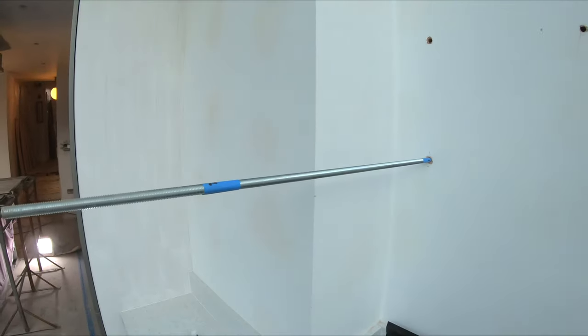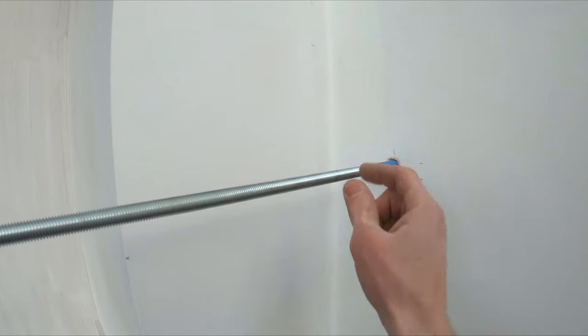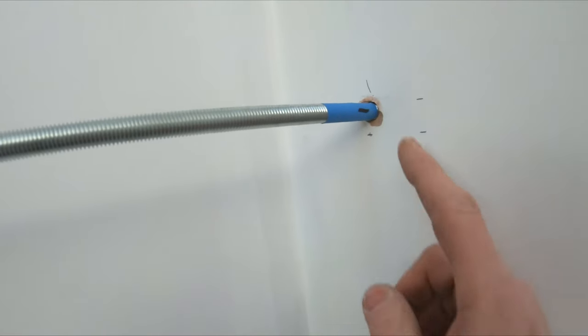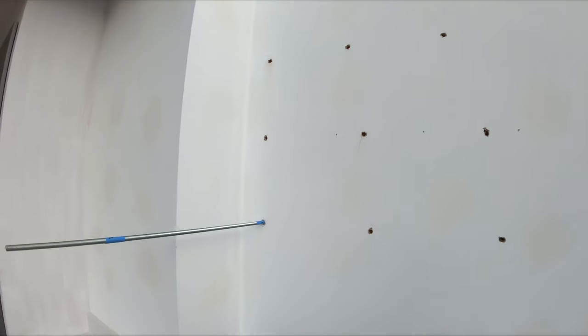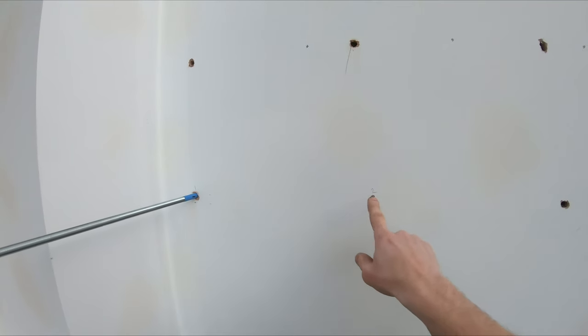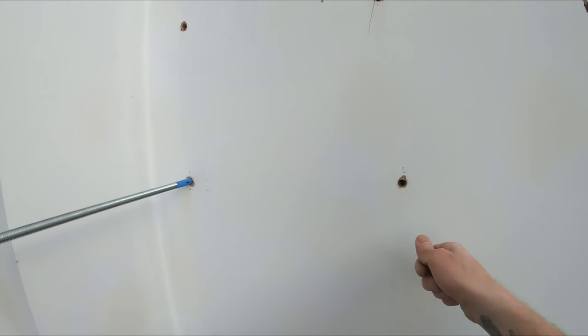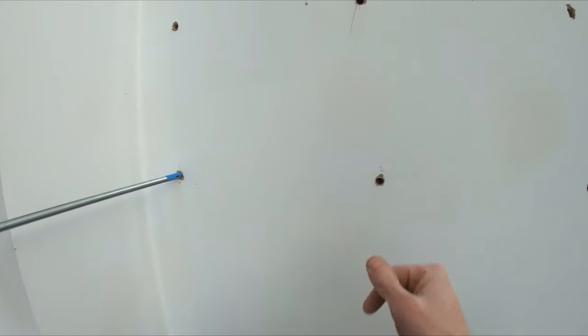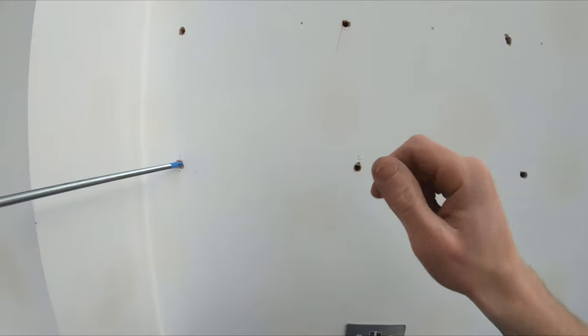All the holes are drilled and ready. The next process is to get the threaded bar, insert it into the hole, mark up exactly the depth, and then work out exactly how much we're going to put into the shelf. I'll tape around it and mark up which hole it's referenced to, then repeat this across all the holes. Then all the bars can be cut and the holes properly cleaned out. If you remember from our anchor resin fix video, you've got to get a blower tool in there to blow all the dust out, then a little brush, and repeat — it's quite a long process just to make sure the resin actually bonds, but we need that exact perfect mechanical fixing.